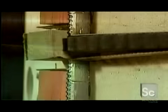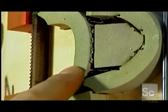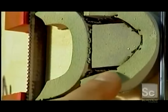First, a trimmer perforates the boards to create flaps and handles. Rubber sponges cushion the blades so that they cut only the parts they're supposed to. During the trimming, a press condenses the box's overlapping panels to level out their thickness. Workers usually cut the sponges by hand to make sure they fit snugly around the blades. The trimmer runs at a speed of 5 miles an hour, processing up to 90 boxes per minute.